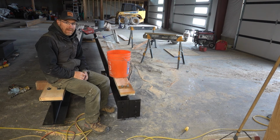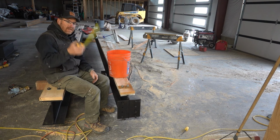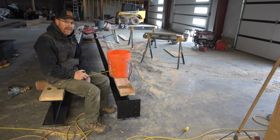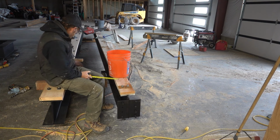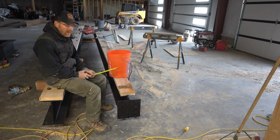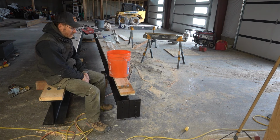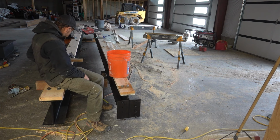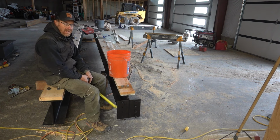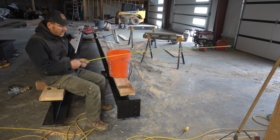All right, another week's gone by, back to Saturday. Gone over to the house and I've measured from the base plates that I anchored on the foundation up to the top plate. You get 10'9¼". This is 13⅞". So I take the 10'9¼" minus the 13⅞". I get 9'7⅜". Another way I check it is I take 129¼".